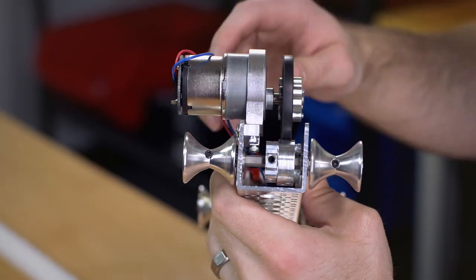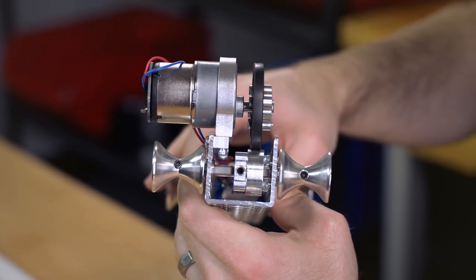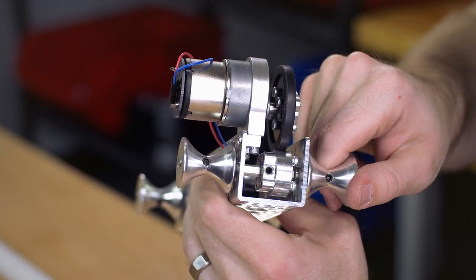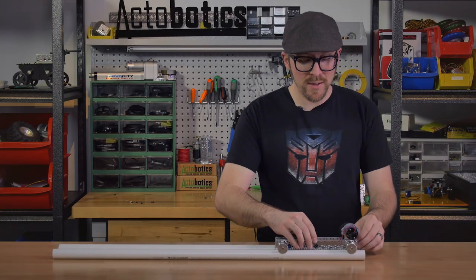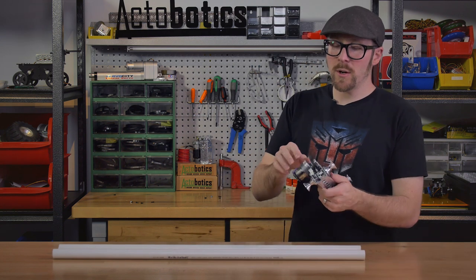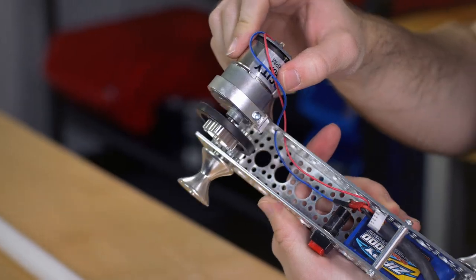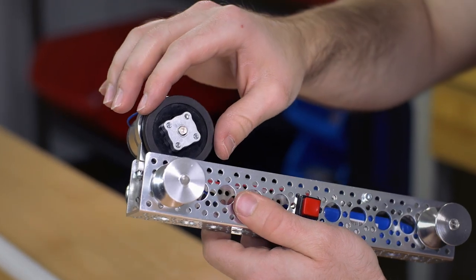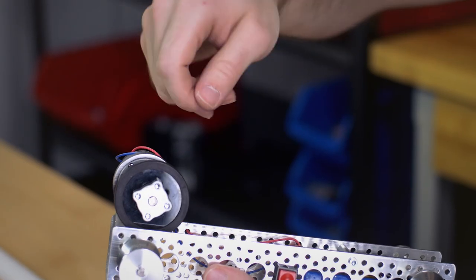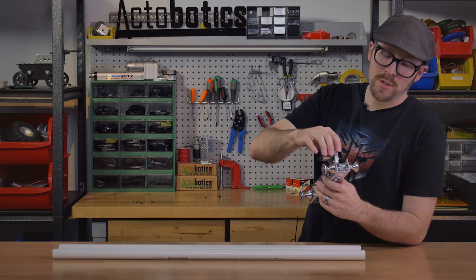Next, we have a version that utilizes a spur gear motor attached via a clamping motor mount, which is bolted to a 90-degree dual side mount. We're just driving this wheel into this hub spacer to turn the shaft. The advantage of this setup is that it's going to be a little bit quieter, and since the spur gear motors have an offset shaft — meaning that shaft is not coming out directly from the center of the motor — it acts like a cam when you turn it. So you can play around with different wheel sizes to get just the speed that you need, then rotate that motor inside the clamp before you tighten it down to get just the right spacing and friction against that hub spacer.